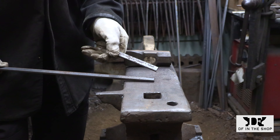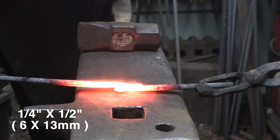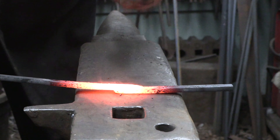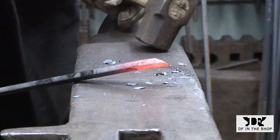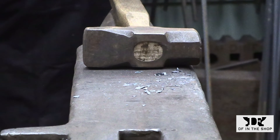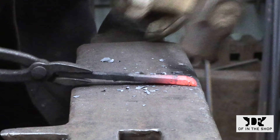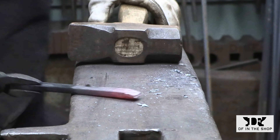I'm going to be doing this demo with a couple of pieces of flat bar. I recommend using something like quarter by half inch flat bar because it's light enough that it'll allow you to go through the heat cycles fairly quickly, but it still has enough mass to give you those few extra seconds you need to get over to the anvil and put the two pieces together. The areas being forged welded need to be thinned down slightly — this is called the scarf — so the completed weld can be hammered back down to a seamless bar. Here I'm doing the bare minimum: just hammering a slight chisel edge on the end of each bar and forging the flat faces together. This is by far the most basic forged weld you can get.